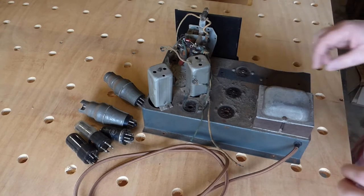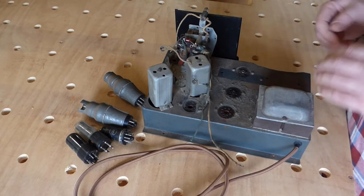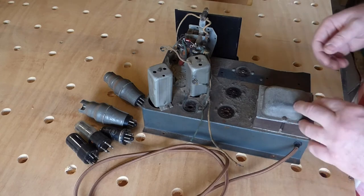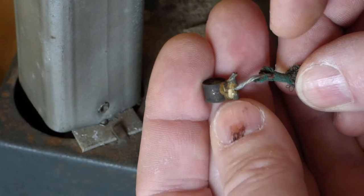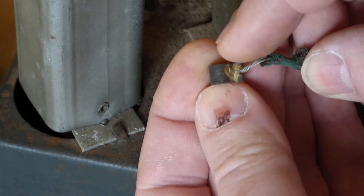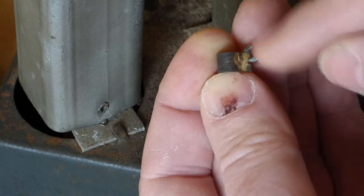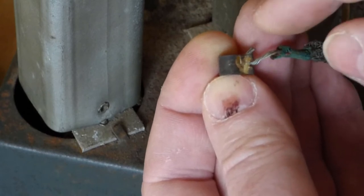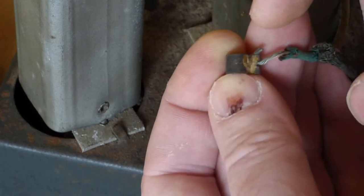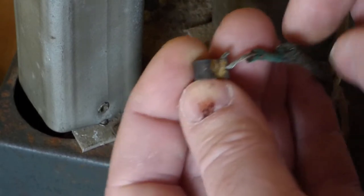My neighbour is going to be a complete pain while I'm doing this, so I apologise for the helicopter noises. To tidy this up I'm going to have to take this grid cap off. It almost looks brazed but it will just be soldered — there are two metal tabs. They've cut a slot into the end and folded the two metal tabs over, and the wire is just hooked under one of them. So I'll apply some heat, prise that tab up, desolder it, put some heat shrink over the wire and then put it back on. That will tidy that one up.